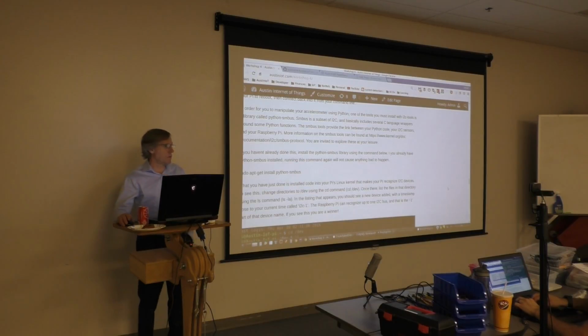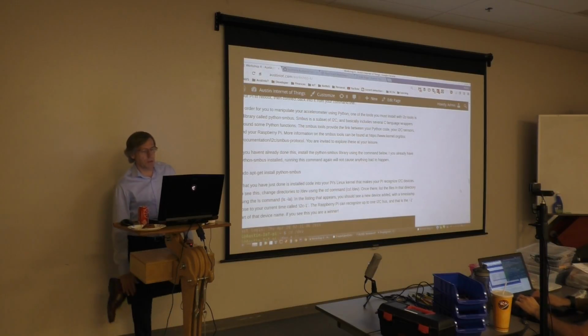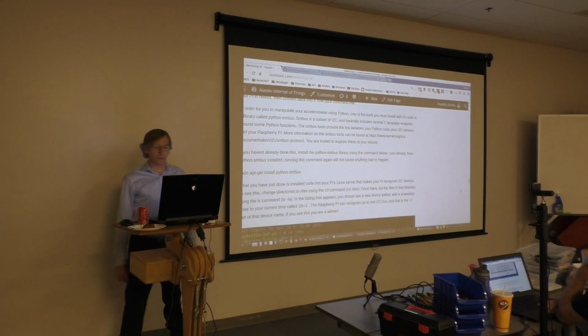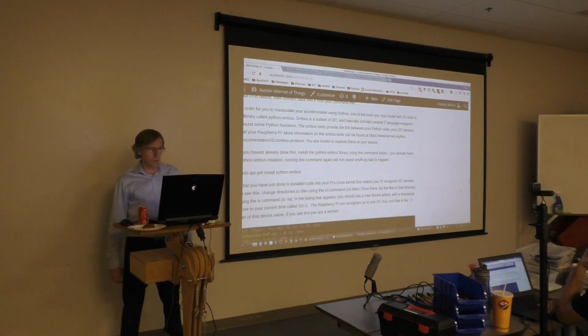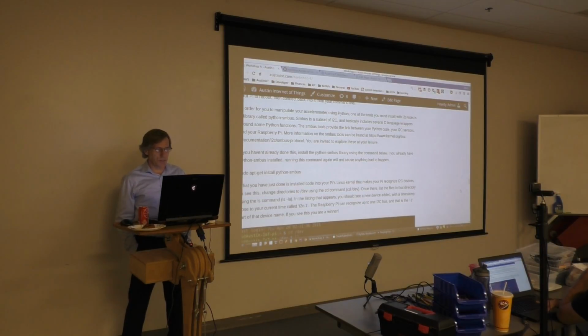Okay, we ready to continue? All right. In order to manipulate your accelerometer using Python, there's a really neat collection of tools baked into apt-get that you can install. It's called Python SMBus, which is an I2C tools library.